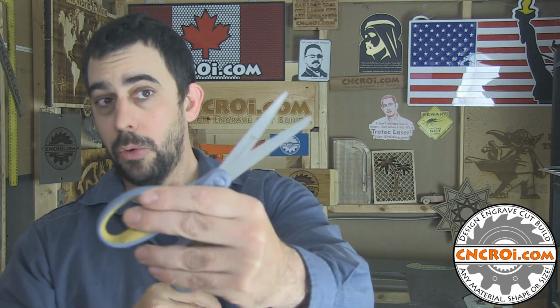The advantage with plywood is that it has a little bit more hardness or durability to it. And there's applications where we have materials that are a little bit harder to work with or sharp. Now, MDF is basically compressed dust and glue. And so let's say we're doing a whole bunch of jigs of, let's say, scissors like this, and they have to be open. What happens with the MDF is that we'll slowly wear it out relatively quickly. But if we make them out of plywood, we don't have that issue anywhere near as badly.